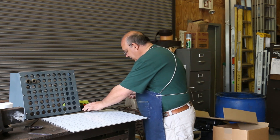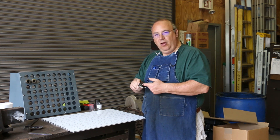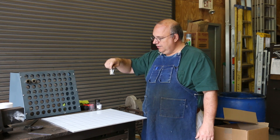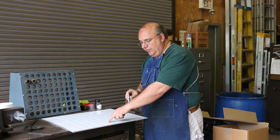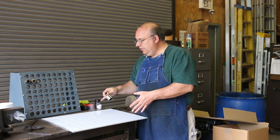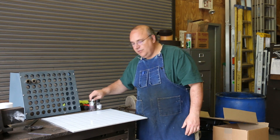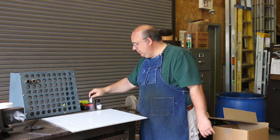I'm going to drill or bore these holes out on my vertical milling machine. What I'm going to use is one of these annular cutters — kind of like a hole saw you may be familiar with in woodworking, except it doesn't have a drill bit down the center. I'll chuck it up in the mill and it'll just bore down, cutting out that disc for each one of these holes. I'll find zero-zero on my first hole and then just move the table over two and a quarter inches for each hole, going back and forth until they're all bored out.